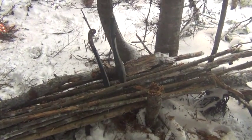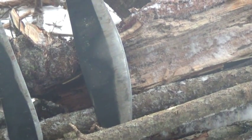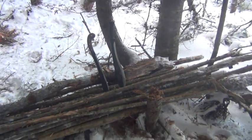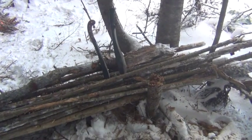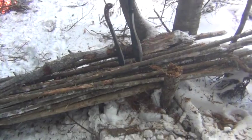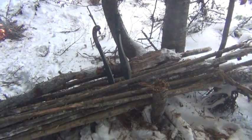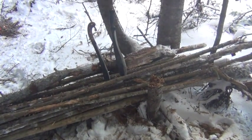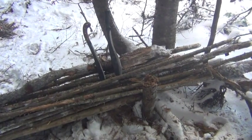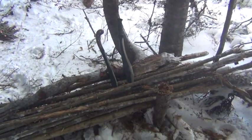There's still room for improvement. Ideally, this primary grind should be extended all the way up to the spine — coming off the edge at around 6 degrees, going about a quarter of an inch, and then slowly bringing the angle down to about a 2-degree primary grind up close to the spine. That full taper will give an even better smooth transition into the wood, reduce wedging, and also cut down on the vibration. It's a lot of work — probably about another hour — but if the handle holds up and it's still in one piece by spring, I might actually go ahead and do that, because it's turning into a very nice blade for this type of work. The only real negative about this knife is that the sheath that it comes with is very difficult to draw the blade in and out of — especially with gloves on, it's kind of awkward. I'm thinking something like a cross-draw setup. In comparison, the Condor goes in and out of its sheath absolutely perfectly, no issues at all.